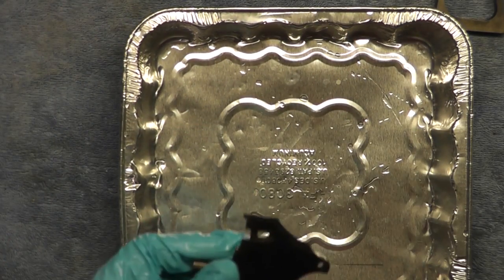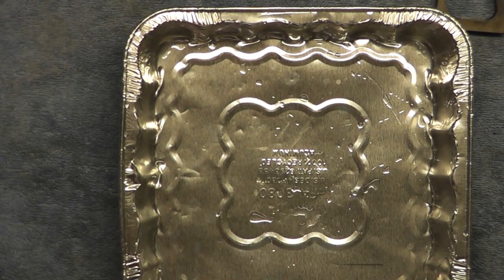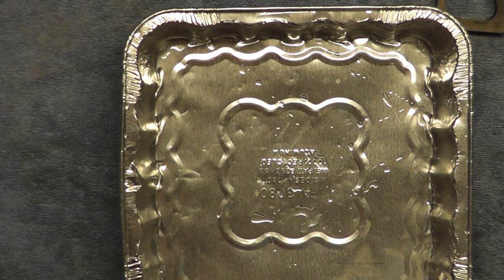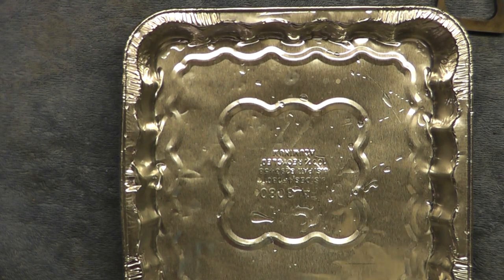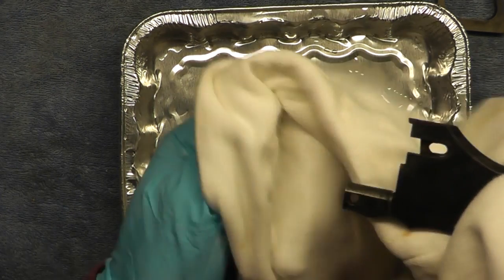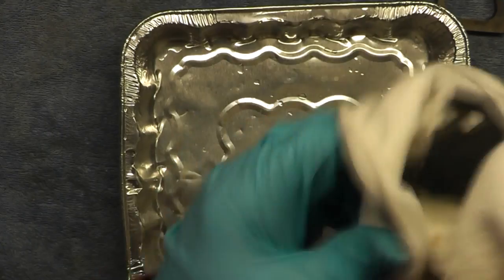Here I'm back after rinsing it off, so let's go ahead and dry it down. The instructions say: allow the bluing to stand 30 to 60 seconds, no longer, then neutralize the chemical reaction, rinse immediately and thoroughly with cold water, wipe dry. After or during rinsing, polish lightly with fine steel wool to blend the color. Appraise the bluing for coverage — if streaking exists or if you desire a deeper darker blue, simply repeat steps 1, 2, and 3 until the desired color is obtained. It's not looking too bad — a little splotchy — but I think we're going to work our way around that.